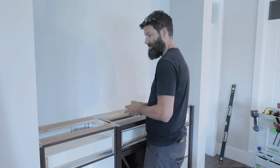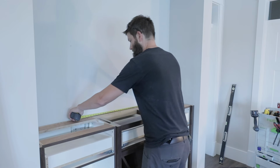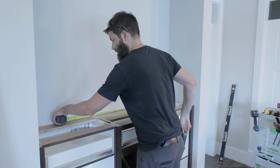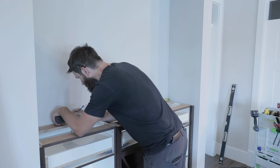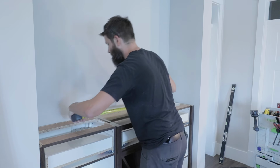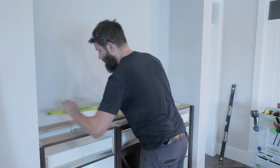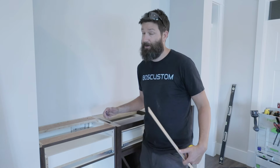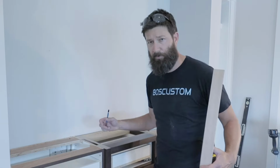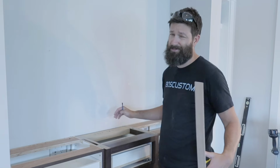So to measure these perfectly, the distance here, I like to just do like a 2-part measurement. I'll come along, make a mark at 50 inches, measure this way, 63 13/16. So I'm going to cut up the pieces for the template, and then we'll come back and I'll show you a quick method on how to put the template together without taking all day.